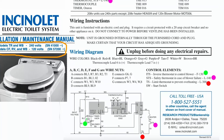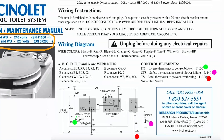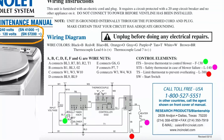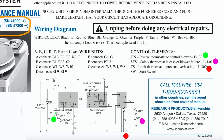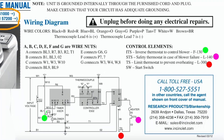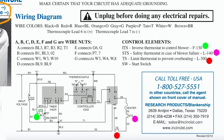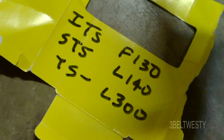The unit in this video has a serial number of 53,000 for a 120-volt model. Mine does have the green cycling thermostat for the blower. It also has the red and violet thermostats, which are safety thermostats for UL — that's in case there's a relay, controller, or thermocouple problem.